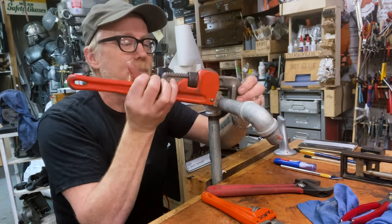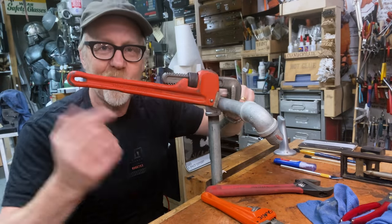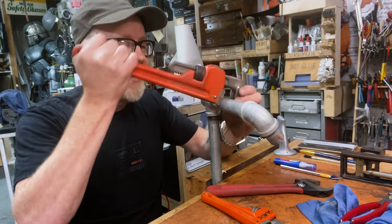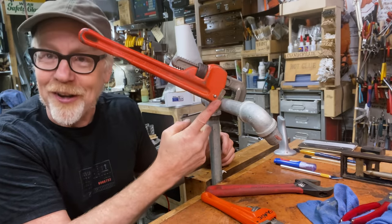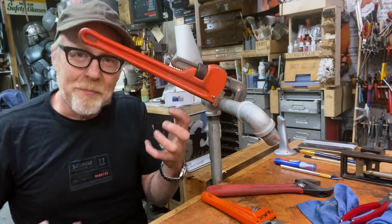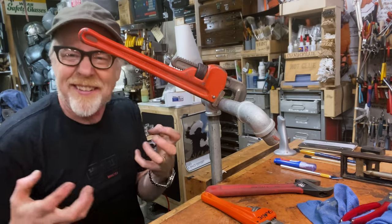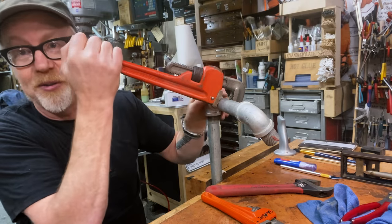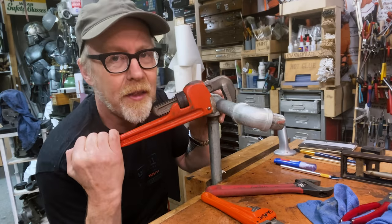What you'll notice is there are serrations on the jaws, and these serrations are actually ratcheted back this way. All of the activity of the pipe wrench is about the relationship between these jaws and your lever action on this nice long handle. So when I set this onto the round pipe, the harder metal of the jaws bites a little bit into the metal of the pipe — that's by design. When it bites, it's biting into a ratchet, so it doesn't want to go anywhere. Because that ratchet's pointed up in that direction, it wants to dig deeper. So when I pull on this lever — and I am actually doing this for real now — I start to move the pipe.